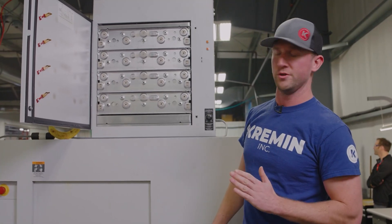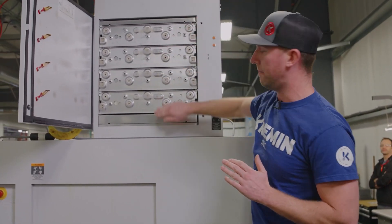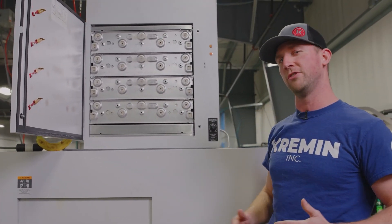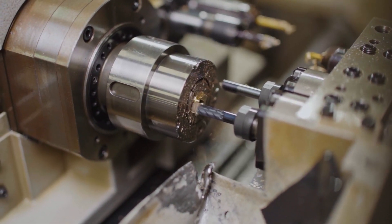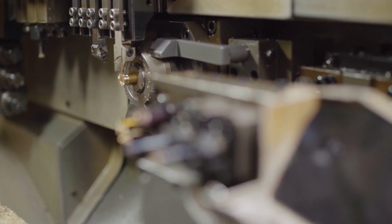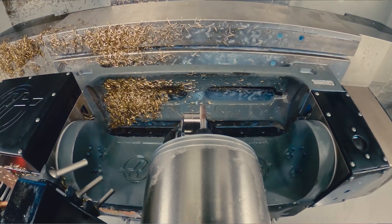As I said before, this is a four-filter unit — one, two, three, four. At the tops and bottoms you can also see there are some other mesh filters. All those are really for is to protect the main filters from having large particulate matter hit them. These are really meant to be more of a baffle just to knock down the heavy stuff before we start drawing really fine particulate out of the air.